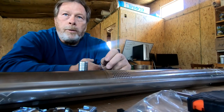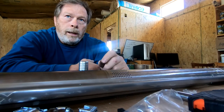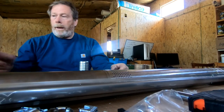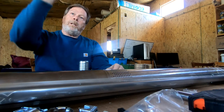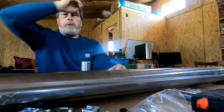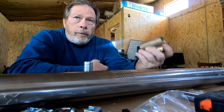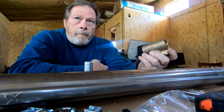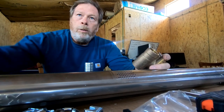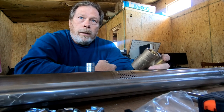In some parts of the country, the ground does not freeze as readily, and so the well pipe, the water pipe, can come all the way up to the top of the well cap and out the well cap and then down into the ground or wherever. Okay. In this part of the country, the ground can freeze pretty deeply. Okay. So if you've got well water in a pipe above that frost, it'll break it. Well, it could freeze. Mm-hmm.